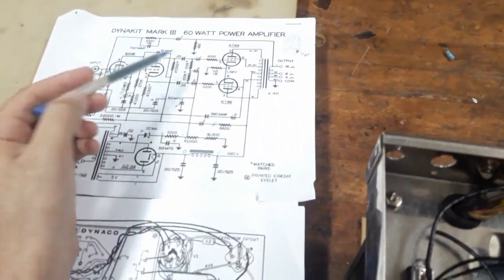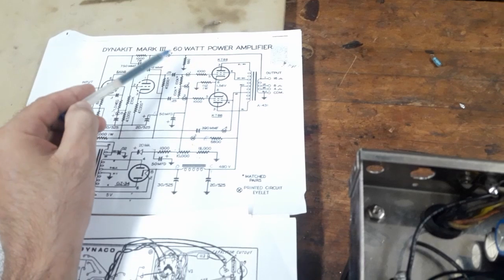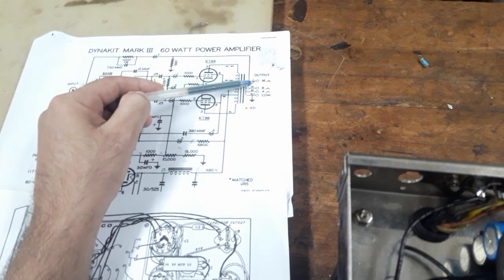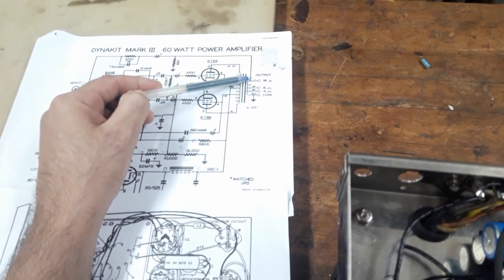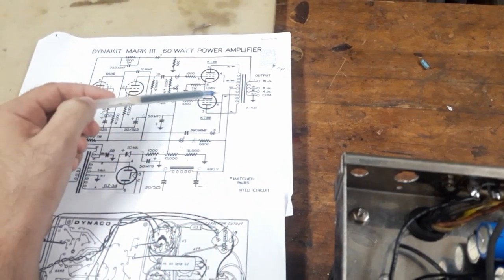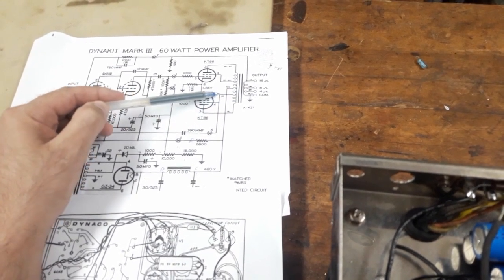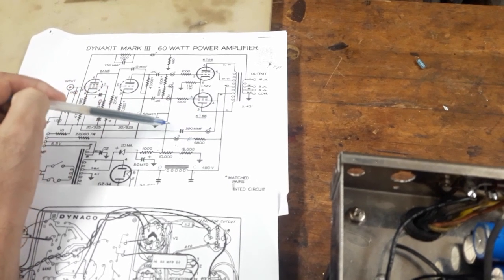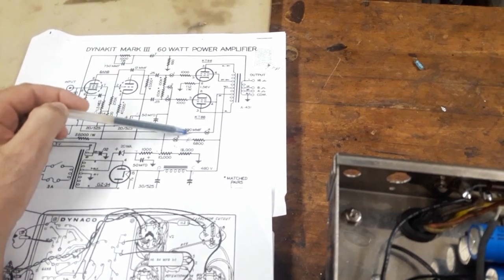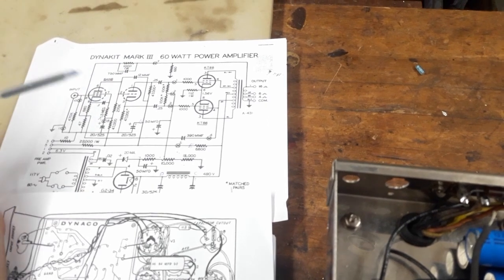Okay, so in this amp, there's two negative feedback loops, right? Which are a thing done to clean up the signal earlier in the amp, and stabilize the amp. So this is the first feedback loop here. It comes from the transformer secondary, and it rejoins the circuit here. There's also a second feedback loop, and that is they take a line from one of those ultralinear taps that I just mentioned, and they feed that back into the circuit at the same spot actually, but through this little capacitor. Before on the other end, it's done through these things here, right?